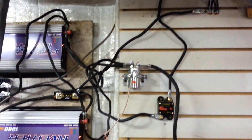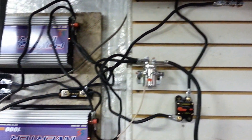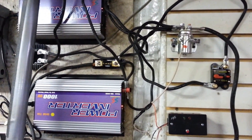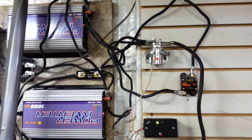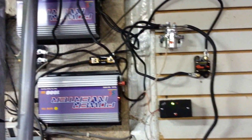I'd like to know if anybody has any opinions — what's the best wiring configuration? I paralleled them so I'm getting max current. The voltage seems to run between 26 and 32 volts, just depends on how much sun I can get. I've seen a lot of systems wired in series — you get a lot of voltage with no current — and I would think current would be better. If anybody has suggestions on wiring, post some ideas and let me know.